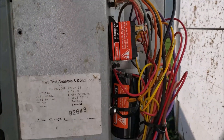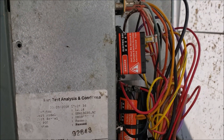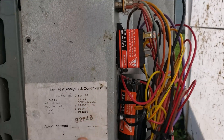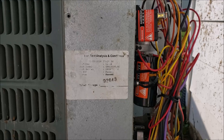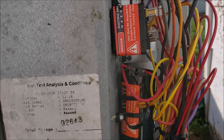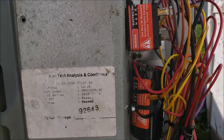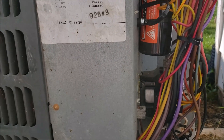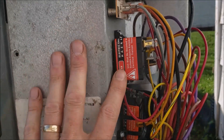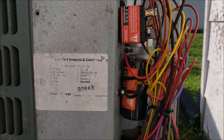Back to the hard start kit - because this thing is about 14 years old, I'm going ahead and putting a hard start kit in. I've been doing that to a lot of my older units before the compressors blow. Whenever I tune one of these up, I go ahead and put a hard start kit on them because they're getting old. I'm hoping that'll prolong the life of them. I do have a video, step-by-step, on how to install these hard start kits - I really recommend it.